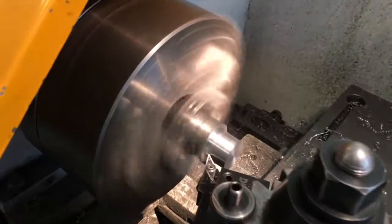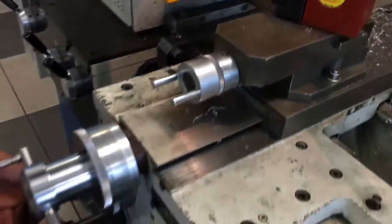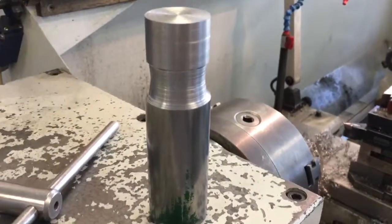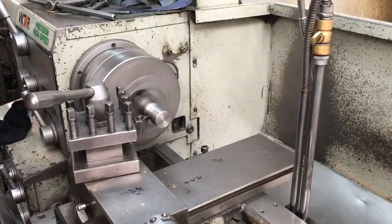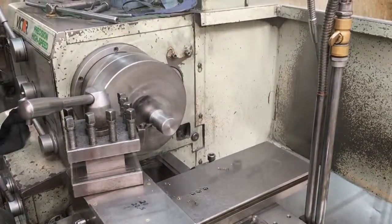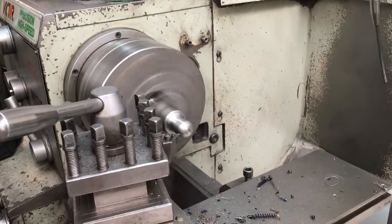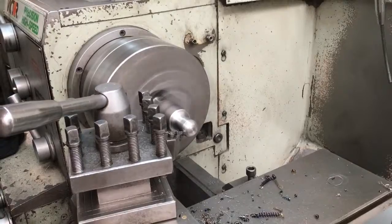After that, you have to move the tool by moving the axis in X and C simultaneously. It is going to be really hard — you have to be really careful on the axis. If you are careful enough, at the end you will have a really nice ball of the hammer.